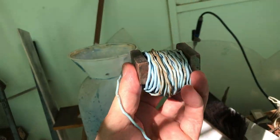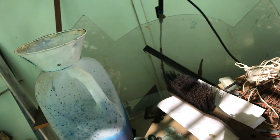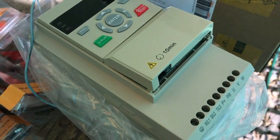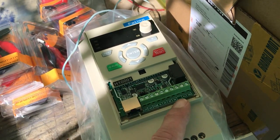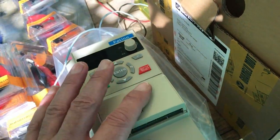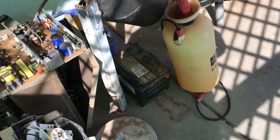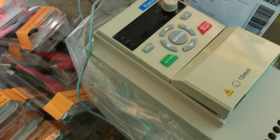I was thinking about making a linear motor. This is my test coil — I'm going to make little U-shaped coils. I can levitate some aluminium. It's a bit expensive just so you can see a piece of aluminium float around. This thing cost $200 but it's pretty good — you can add extra switches here to remote control the mechanism. I put that coil just for a test on that dead battery, about seven volts, and it pulled out 12 amps. I might scale it down and make smaller coils, around two feet long, which would be an interesting linear motor build.